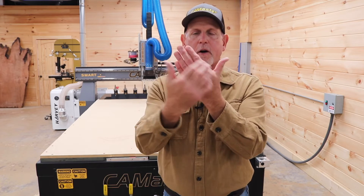Number three: efficiency. If you're considering an investment like this, it's likely because you've reached the maximum potential of your CNC and still need more — and that was my case. I do a lot of outdoor business signage, typically carved HDU signs. They're double-sided, but I carve two pieces that get laminated together. I carve the outside face, but also the inside face to capture mounting and bracket hardware. On the inside face I might have a couple of tool changes; on the outside face I might have four, five, six, seven, or eight tool changes depending on the order of operation. So on each side I might have eight to ten tool changes.